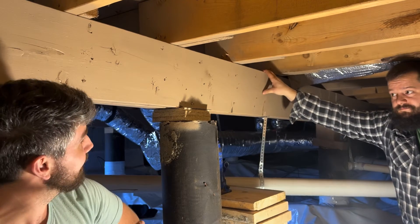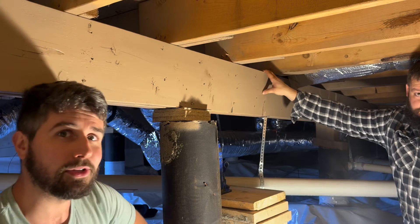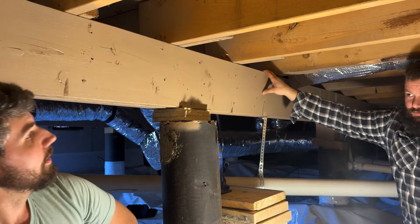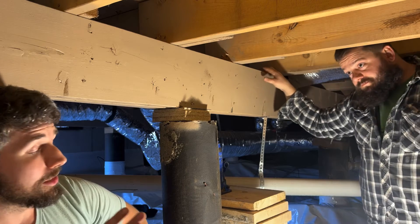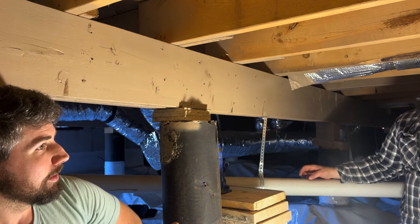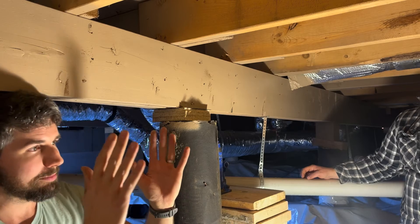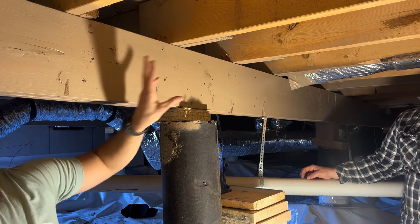If you have any questions about shimming or about how there could possibly be a floating pier in a home, leave that question down below. How would you know this is going on? Symptoms of smooshed pier shims: for this home they had drywall cracking almost all over, which was a good sign that all the shims were sinking. Also, on this two-story home the doors on the second story were not shutting all the way — they would either hit on top or not latch. So those are all signs that your home geometry is slightly shifting. You don't need a very large compression down here to equal a large shift up on the second story above it.